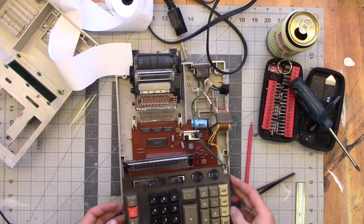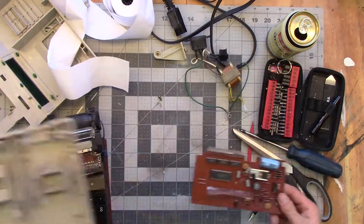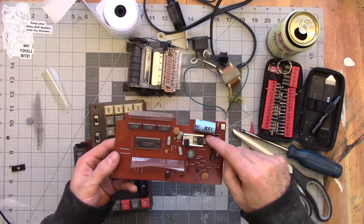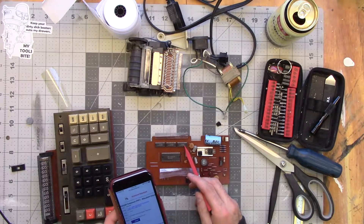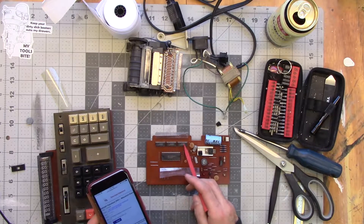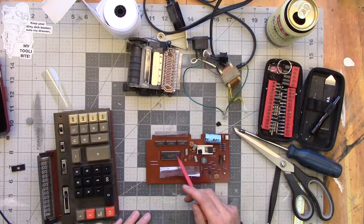And then you've got your keyboard that sits on top here with the built-in screen. You've got a big capacitor, a couple of diodes and a rectifier of some kind here - that's going to be knocking the AC power off of the transformer down into DC. Then we've got some chips over here that I'm going to assume are maybe memory, but we'll look those up. These guys here are transistor arrays - they are seven unit Darlington transistor arrays, meaning there are seven transistors in each of these. A transistor is just an electronic switch - it just switches things on and off. All of the mathematical functionality, the printer, the display - everything is basically on this single chip right here.